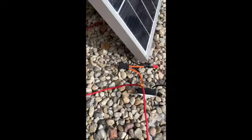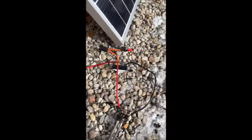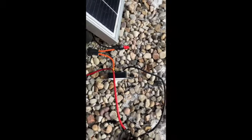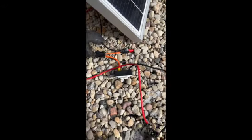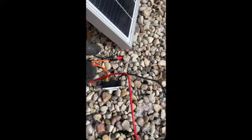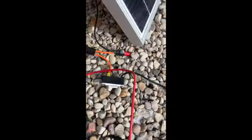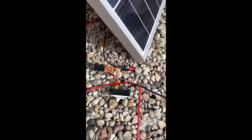So, you know, just pulled my fuse, and then we have no continuity, so I'm not in any danger of getting zapped. I'd have to connect up again. I mixed my wires up, so this is actually my positive wire, not my negative. I put the wrong MC4 on the wrong wire. Which is okay. I said before, I just taped the end of the wire so I'd know which one was the positive and negative, and the MC4s only connect one way.